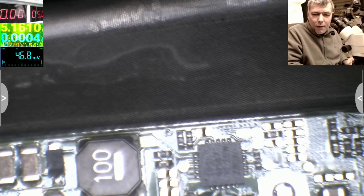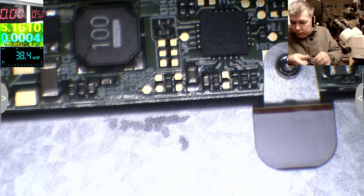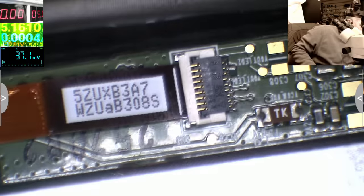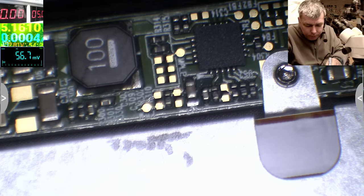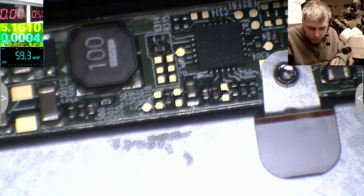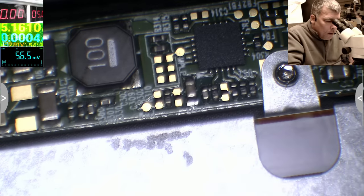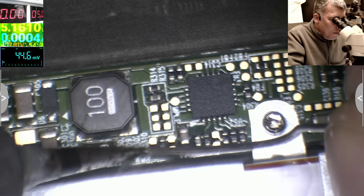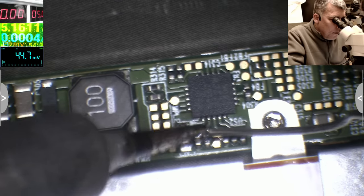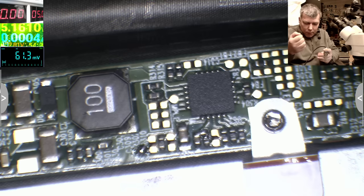Okay. So let's just make a bridge like always. So the screen is not faulty. The screen is fine. Usually when there's no backlight, actually the screen is fine and one of the signals is missing. Okay. So we will do a bridge from here to here. These two are together anyway. Let me grab a wire. You see, always the wires are solving the problem.